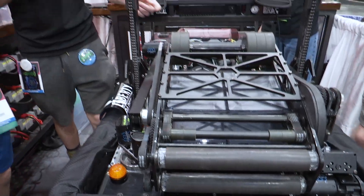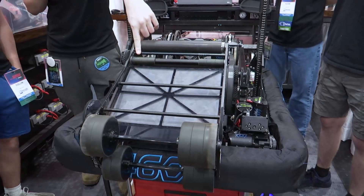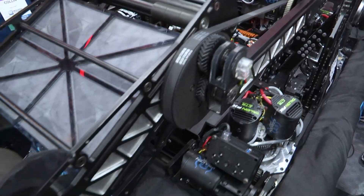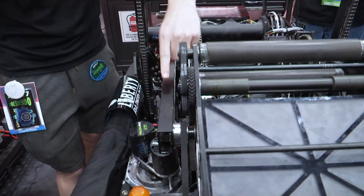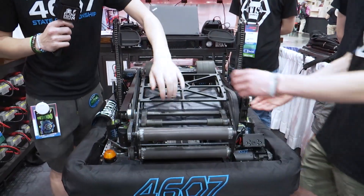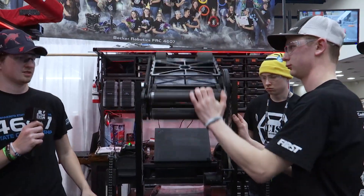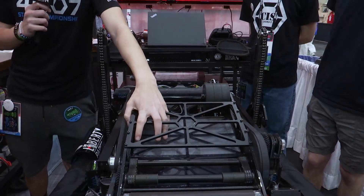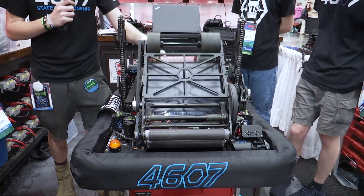The flywheel side is on a dead axle but the kicker side is on a live axle. One of the recommendations from our controls department was no motors or wires going out to the wrist, to avoid added wiring complexity or weight. Having the belts in the tube and everything rotating on the same axle allows this to do a full 360 an infinite number of times within the robot without ever worrying about wires.